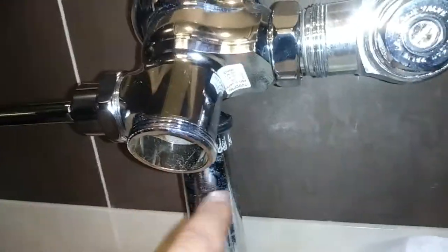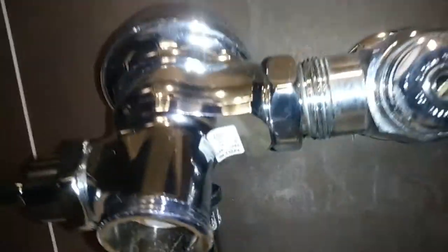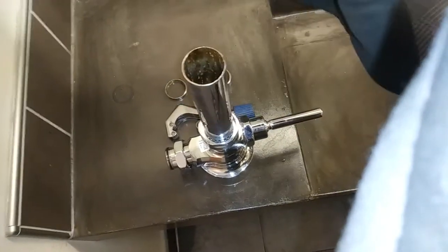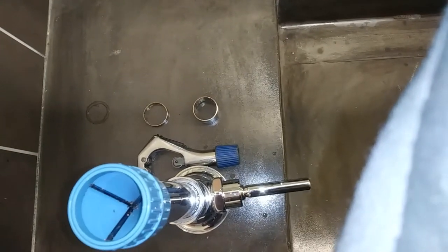As you can see here, I didn't take this into consideration — the tip piece needs to be shorter. This was longer than the handle. I'll probably pull that out and cut it with a tubing cutter. Always remember to deburr your pipe. Also, don't forget to measure twice and cut once.